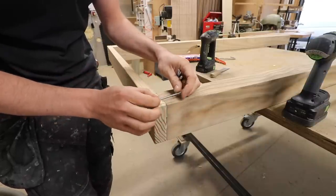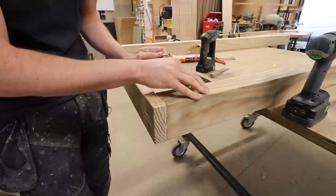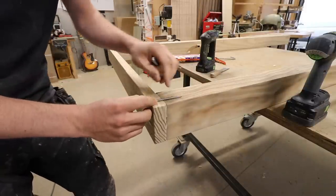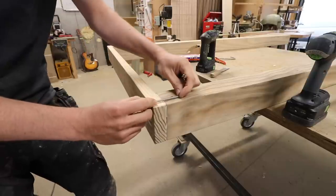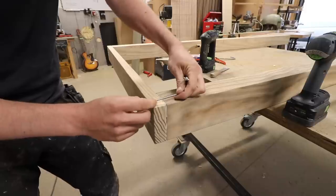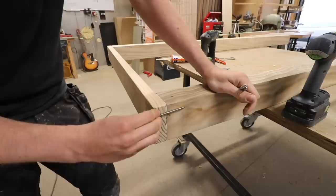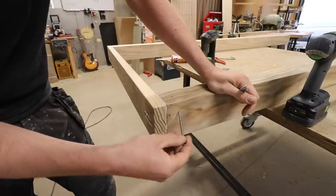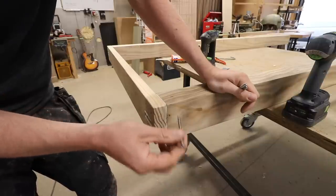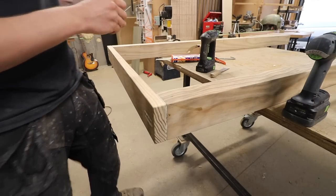So the only difference is if you're using a 4mm pilot hole with a 5mm screw, you're putting very little sideways pressure on this piece of timber, and it's much less prone to splitting in the future. So if any stresses act on the fixings, because you've already taken that stress out of it by giving it a pilot drill, it's not going to split at that point. Whereas if you whacked a 70 or an 80mm screw straight into that piece of timber, it'd probably take it, but it's more likely to snap the screw and it's more likely to split that piece of timber, especially in time and especially if you're not using a pilot.